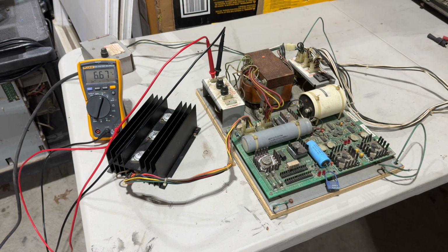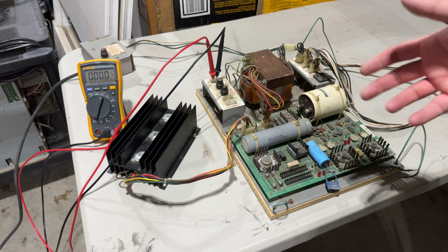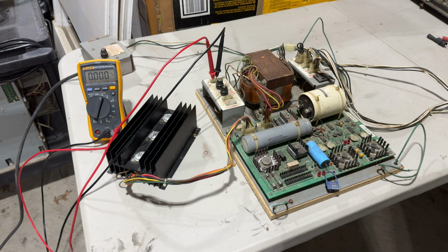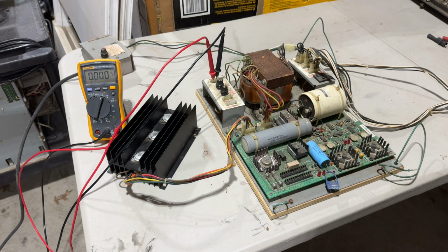Let me actually turn this off and let this power down for a second. So I believe there's actually a couple of overvoltage protection circuits in this cabinet. So we might have blown a fuse. Let's see. And there's a couple of crowbar circuits where if the 5 or 12 volts gets too high, it basically, like a crowbar, opens up a circuit and it stays open until you power the thing off. So let me do this. It's powered down, hopefully discharged enough. I'll see if those lights flash on again, because that'll tell me that the crowbar circuit maybe is working.